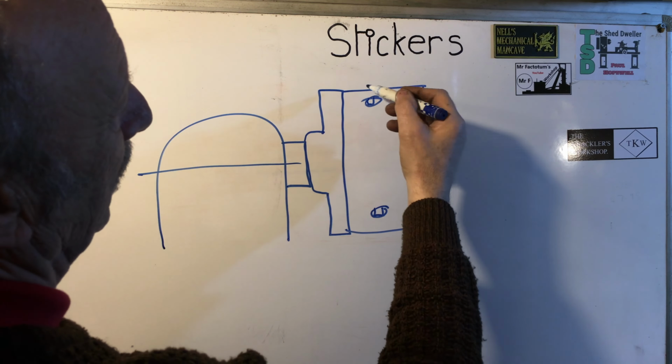After removing the chuck from the spindle nose, a close visual inspection of the chuck backplate indicated that the spindle nose stop face was only making partial contact with the chuck backplate. So my task is to find out what face is out and by how much. My DTI indicated that the nose stop face was 0.03 millimetres out of flat. That's just over a thou.